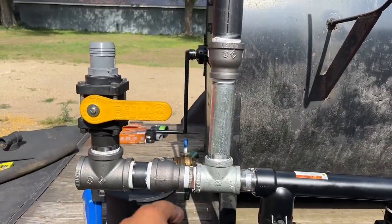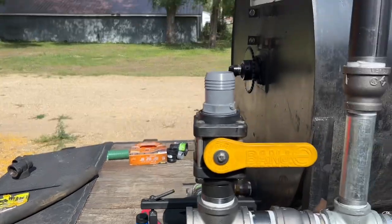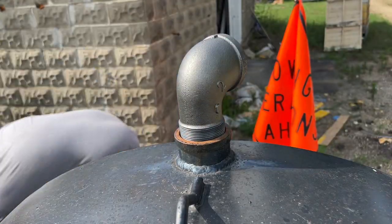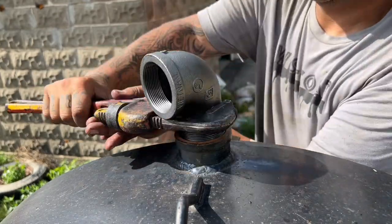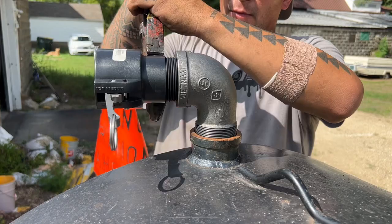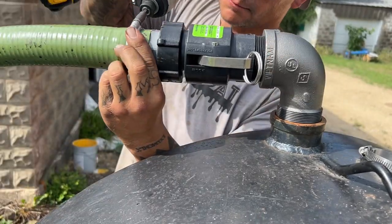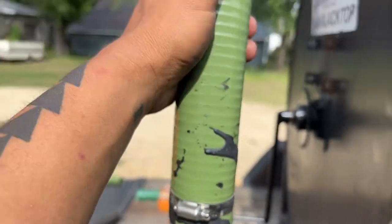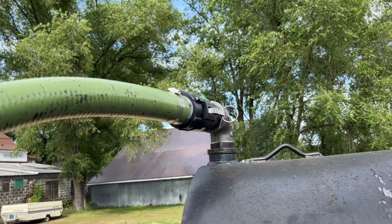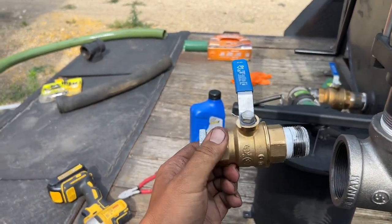So we left this here at an inch and a half and upgraded to two inch. This is our valve that's going to go to our return to the top, and then this is going to get reduced down to three-quarter for the spray hose. We're going to put this together with that gator grip at the top, and that'll be it for the return. We didn't end up using a nipple here — this old piece of green hose had a threaded part on it, so we just put that into the valve and then connected that to the gator grip up on top.